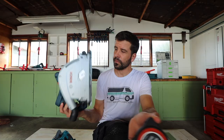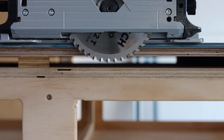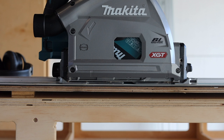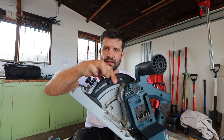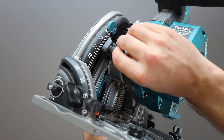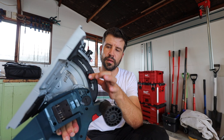The Makita I've been using most has a 165mm (just over 6-inch) blade, while the Bosch saw has a 5.5-inch blade — about 140mm, so it's less. On its track, the Bosch cuts to a depth of 46mm; the Makita 40-volt on its track cuts as deep as 53mm, so you get a bit more with the Makita. Where I think the Bosch stands out is the depth adjustment — this is a thing of beauty. You just push the red button in and move it up and down. Look at the different numbers, push it up — yep, 12mm, I'm happy with that, let go. The Makita still has the wind-up knob, and that just takes that two seconds longer. Multiply that by the amount of depth adjustments you do and you realize the Bosch is far more convenient.